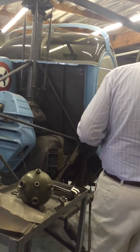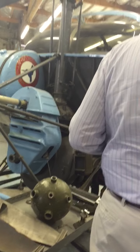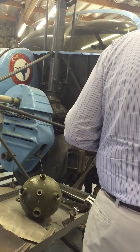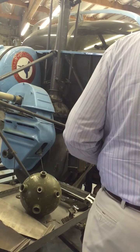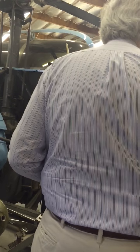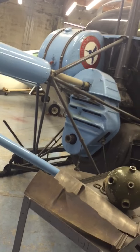The helicopter engine spends a lot more time at full power. Whenever you're hovering, you're at near or somewhere close to full power, whereas an airplane is primarily at full power only for a couple of minutes or five minutes or so to take off and climb. These will spend a lot more time. Also, when they're at maximum power, they're usually at minimum airspeed, so there's not a lot of air flowing over the engine. So they've got a cooling fan to drive air over the engine and keep the engine cool.